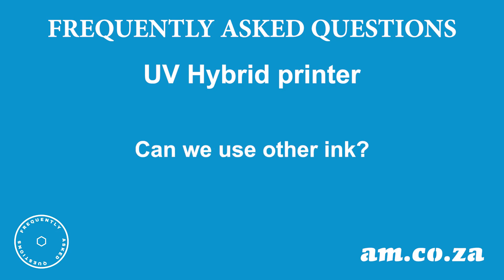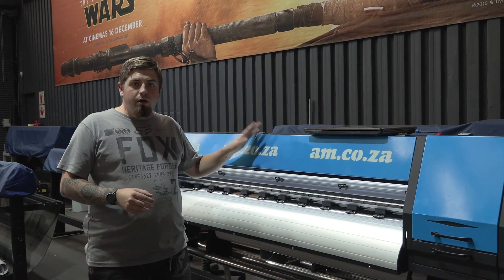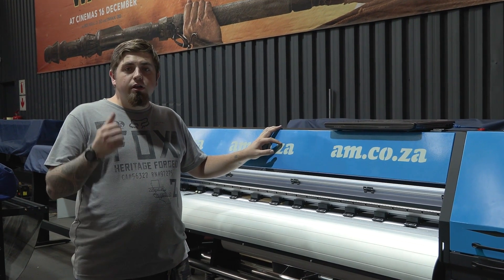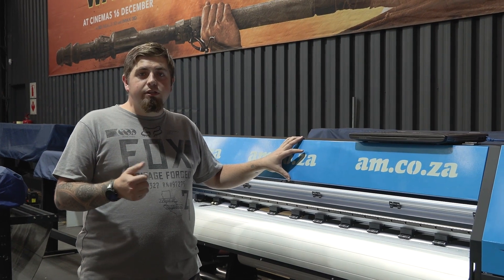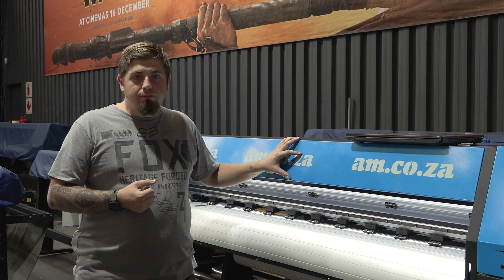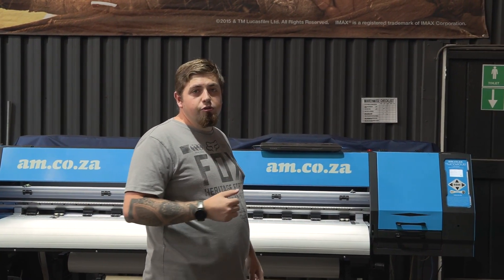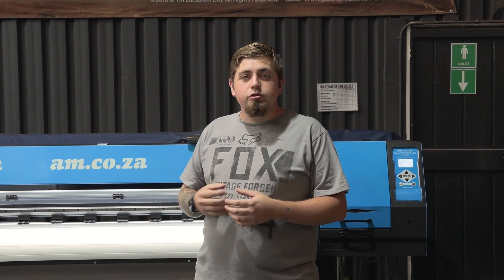Can we use other ink? Our UV hybrid printer is an extended version of our base model without lights as well as extension tables. These hybrid printers can take a multitude of inks such as dye-based sublimation ink, which is water-based, as well as eco-solvent and UV inks. Keep in mind that UV ink needs a UV LED to actually cure faster than other inks, which has an advantage over clarity and ease of use. AM does produce and stock a multitude of inks; however, once you've put in a certain type of ink you cannot just change it the next day without incurring a lot of costs to your print and inking system. It's always best to use AM's inks because of warranty — if you use other ink, your warranty and technical support are void.